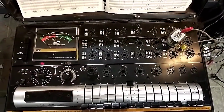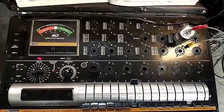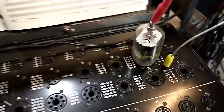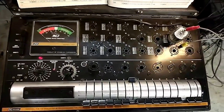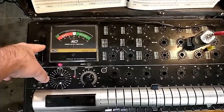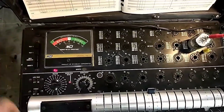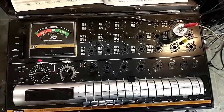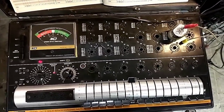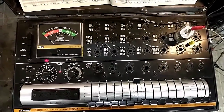Probably the most dramatic was the horizontal output, which I think barely registered above zero, and since we had no horizontal drive it made me wonder. So we've got this Sylvania pulled from another chassis and I'm going to see if it's any good or tests similar. As we can see, there's a dramatic difference between this used one and the other used one, which registered just above zero. So if there's a question of tester vs. tubes, I'm thinking it really was the tubes — I used this tester recently on brand new EL84s and they registered as they should.